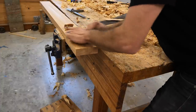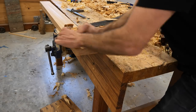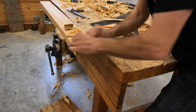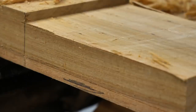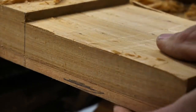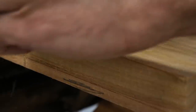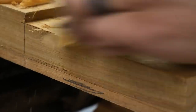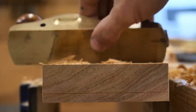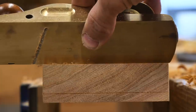So here we are, I've got a really cool low angle block plane here by Lie-Nielsen. It's a rabbet plane on one side so the blade goes all the way to the edge of the plane, and it's also skewed so it helps cut the fibers of the wood especially across the grain. This is a great example of how valuable marking lines are with layout gauges or knives because you can actually plane down right to the wood fibers as opposed to a pencil line — so it's much more accurate, you know where to stop. The key is just keeping it flat across the whole width of that tenon. You can see I'm checking the flatness here and it is pretty much spot on.